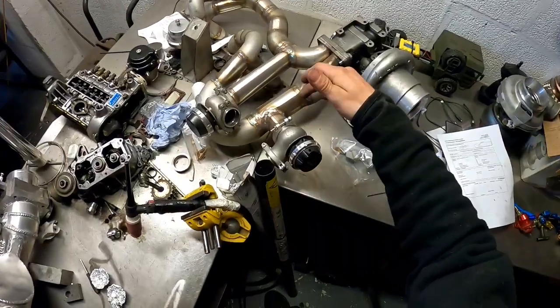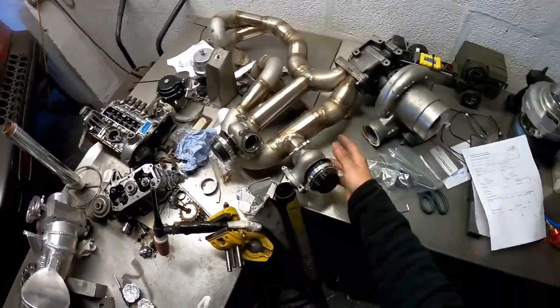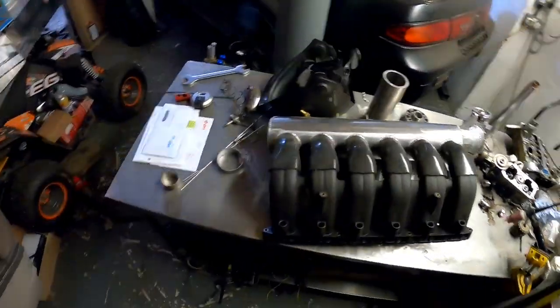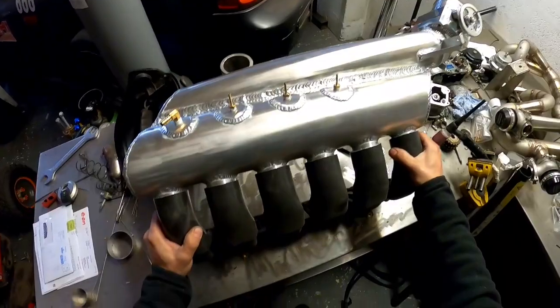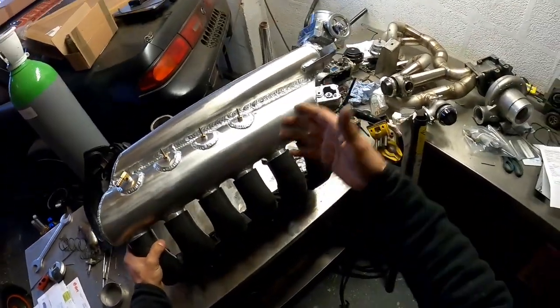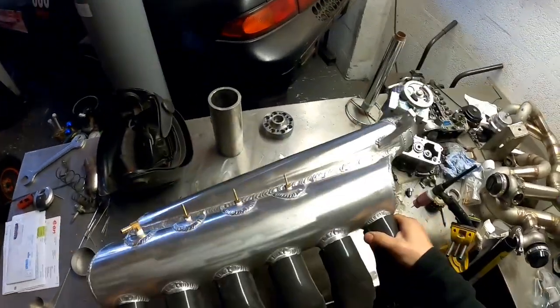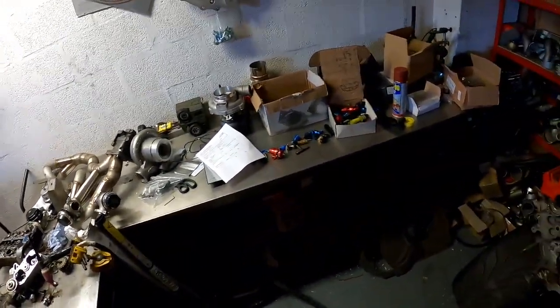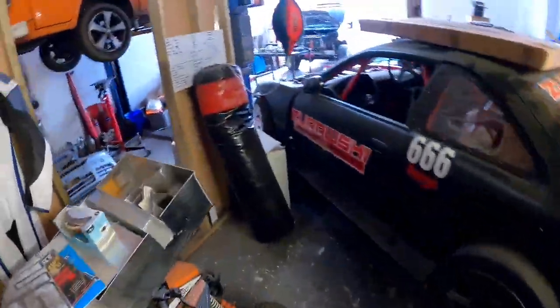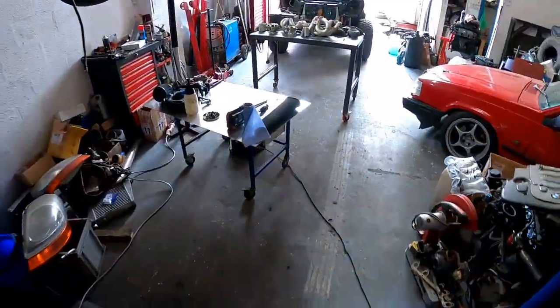And obviously you have 2 wastegates, one on this scroll and one on that scroll, because they have to control them separately. And the intake plenum, I have to send this off to France. Now, this is a different topic. We're going to be here for hours if I cover this, so another day maybe. And so exhaust manifolds, I think that's it really on exhaust manifolds.